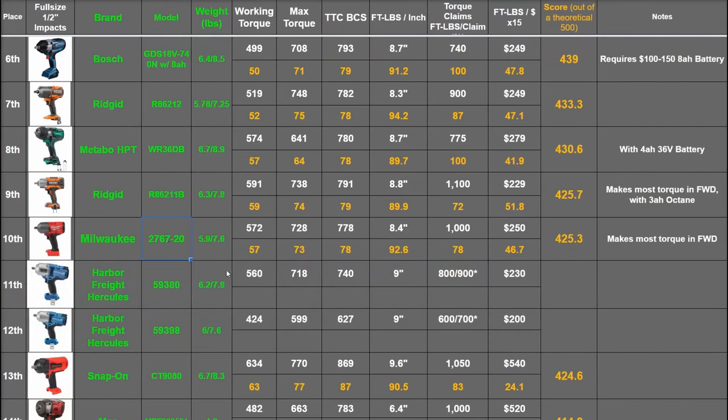Let's settle this on a leaderboard with points now that we have all the data to really see who comes out on top. Starting below the 2767, these two models' test runs are turned into points as 56, 72, and 74, and 42, 60, and 63. They are both the same length but the ultra torque makes a lot more power for not a lot extra cash — achieving 82.2 foot-pounds per inch and 70 foot-pounds. Their torque claims are a bit more convoluted, but we're loving the extra data either way. Achieving a clean 30-second run was essentially impossible for us, but even then it was close to this 740 versus 800 relationship. So we're happy with 93% and 100%, or max points, for the high torque. If someone somewhere in Harbor Freight's aim was to score more points with their fans for more accurate or honest torque ratings, they did it.